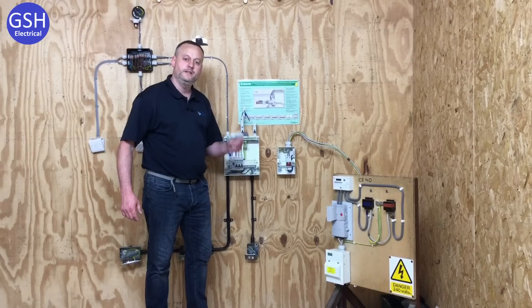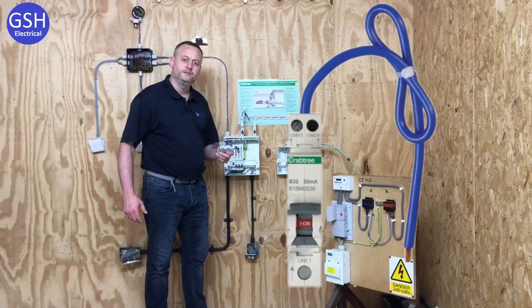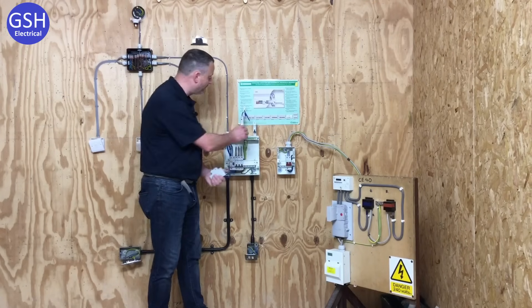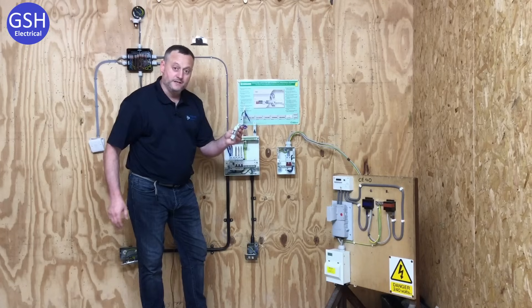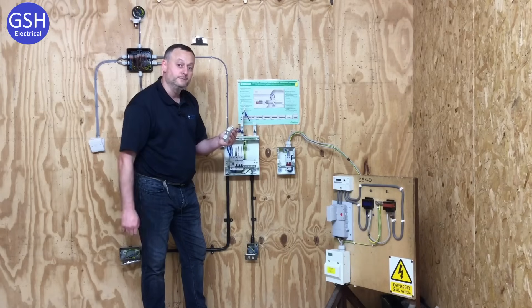In this video presentation we're going to continue to look at the miniature RCBO, in this case the miniature RCBO made by Crabtree. We put a video up a few weeks ago and in that presentation I was asked many questions, mostly about the test button. The test button on this one is located at the bottom of the switching mechanism, so there were questions about whether the mechanism would be restricted by the finger press, because previously on the larger style RCBOs the test button was at the top. In this video we'll connect up this RCBO, liven it up, press the test button and see what happens to the switch mechanism in relation to our finger's position.